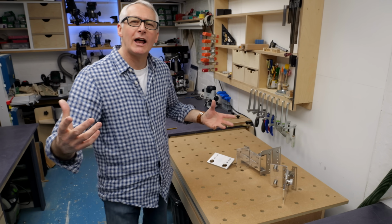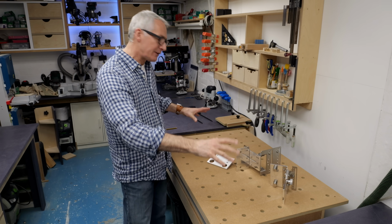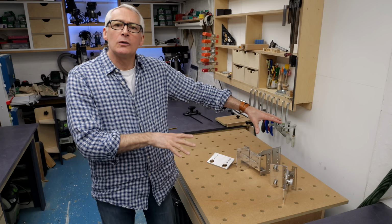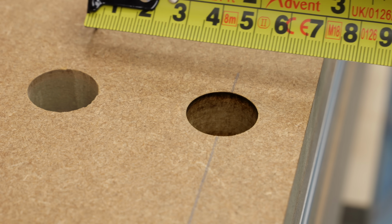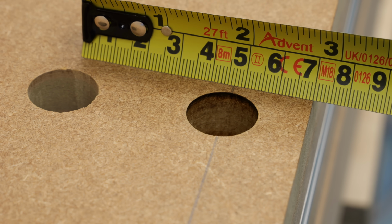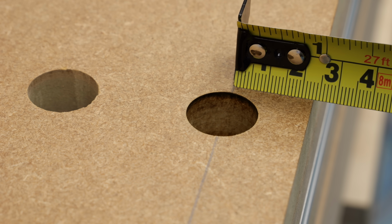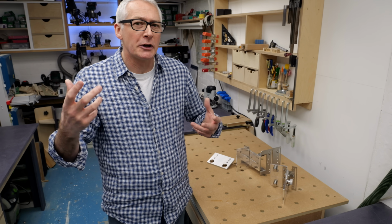So in a normal MFT or MFT3 top like this one, it has a grid of holes 11 across and 7 high, and those holes are on 96mm centres, but typically around 70mm away from the edges. The Benchdogs hinge aligns these mounting holes with columns, but at 24mm centres away from the edge, and this is where the optional third part that I mentioned earlier on comes into play.